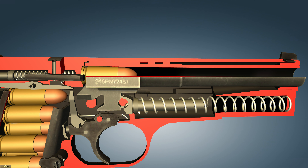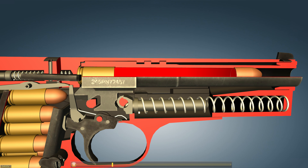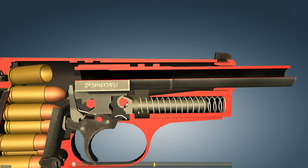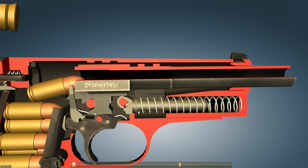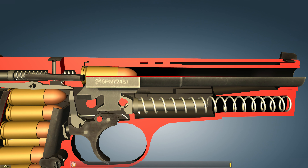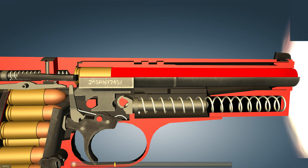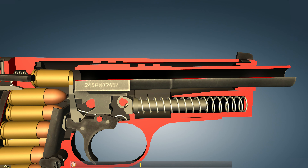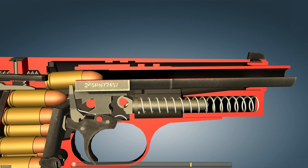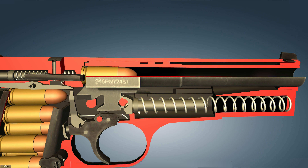The High Power, like many other Browning designs, operates on the short recoil principle, where the barrel and slide initially recoil together until the barrel is unlocked from the slide by a cam arrangement. Unlike Browning's earlier M1911 pistol, the barrel is not moved vertically by a toggling link, but instead by a hardened bar which crosses the frame under the barrel and contacts a slot under the chamber at the rearmost part of the barrel. After the slide reaches the limit of its travel, the recoil spring brings it forward again, stripping a new round from the magazine and pushing it into the chamber. This also pushes the chamber and barrel forward, and the cam slot and bar move the chamber upward so the locking lugs on the barrel re-engage those in the slide.